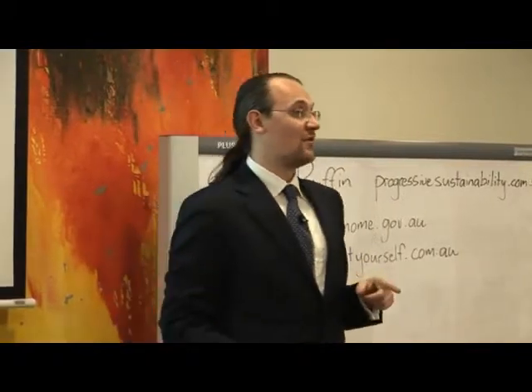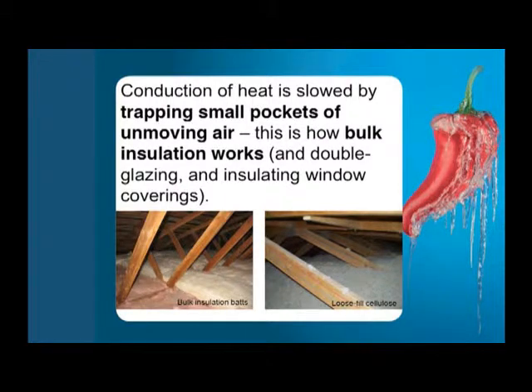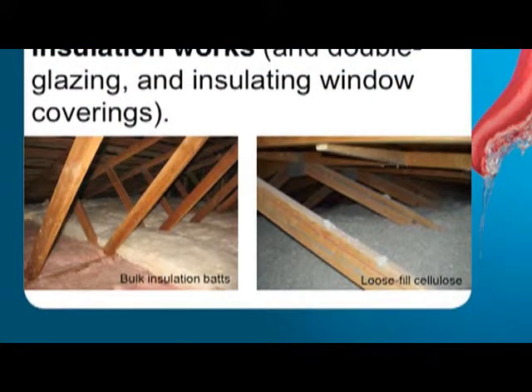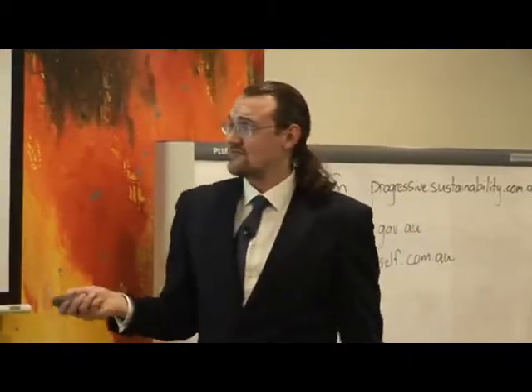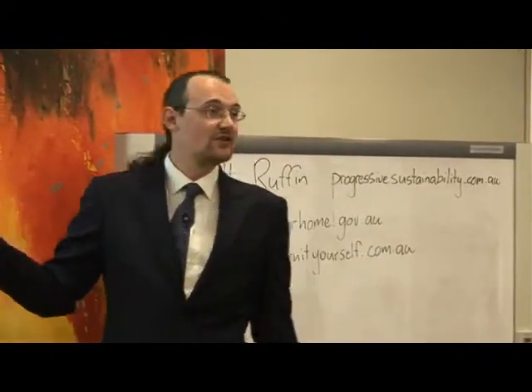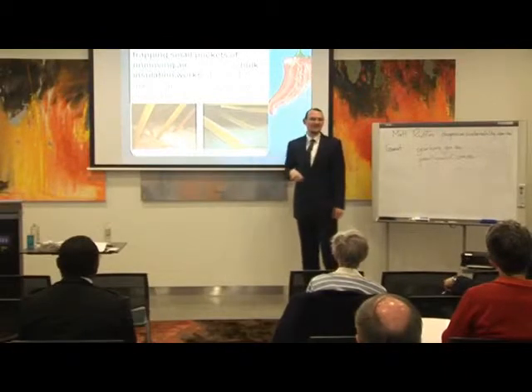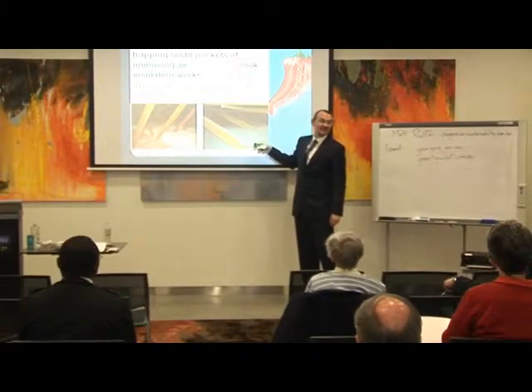Insulation will also help you in summer, but it'll help you most in winter. It's all about trapping small pockets of unmoving air, and down here we've got some nice pictures. This is some really well-laid insulation bats — you can see they're well-laid because there aren't gaps. Gaps vastly reduce the effectiveness of insulation. You want as much coverage over your ceiling as close together as possible. This is some loose fill cellulose. Loose fill is fine as well, although it does make it a bit more difficult to get back in the roof space and do anything, because you can't see where the joists are to walk on.